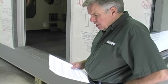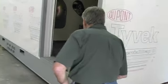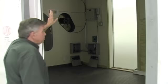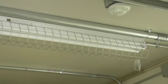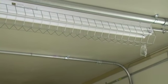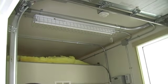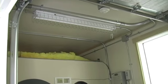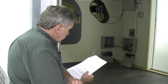After the power is connected, the thing you want to do is unpack and install all of the fluorescent tubes into 2 fixtures. There's a fixture in the front of the unit in the operator's area, and then a fixture in the back where the water connections are. Each one has 2 tubes and has a metal cage. These have been shipped separately so that they don't bounce out during shipping and break. So you'll have to look for the box that has the fluorescent tubes and also the cages. So you need to install the tubes and the cages.